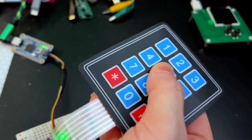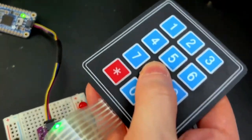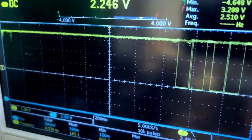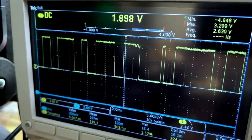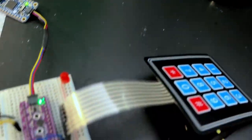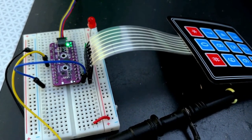So as I press these buttons, you see it outputs key up events. And it has a queue, which is going to need a 10-key queue. There's also an IRQ pin, and I'm monitoring that with my scope. Every time I press a button or it releases, you see the IRQ go off. So all this is working out. I've tested all the GPIO pins, and they are good — the queue and the reset. So this is getting ready to go into the Adafruit shop soon.